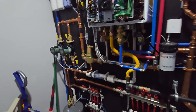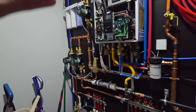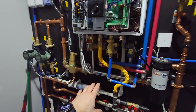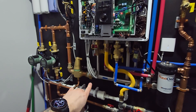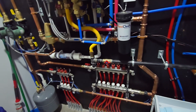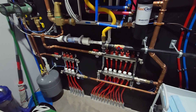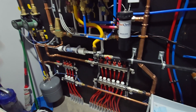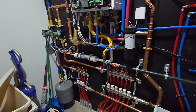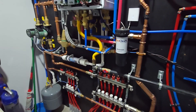You have to think about a few things, and this all comes into design. I won't get too detailed as far as delta T's and whatnot — I just want to explain the benefits of it and what it's doing. So when that hot water is mixing between the primary and secondary loops and feeding into the pumps, you're going to lose heat going through your heating zones, and that's the point — that is what's called delta T. The difference from what's going out versus what's coming back is called delta T. Say it's 20 degrees — you're losing 20 degrees from your heat emitters, whether it's radiant heat, baseboards, radiators, or whatnot.